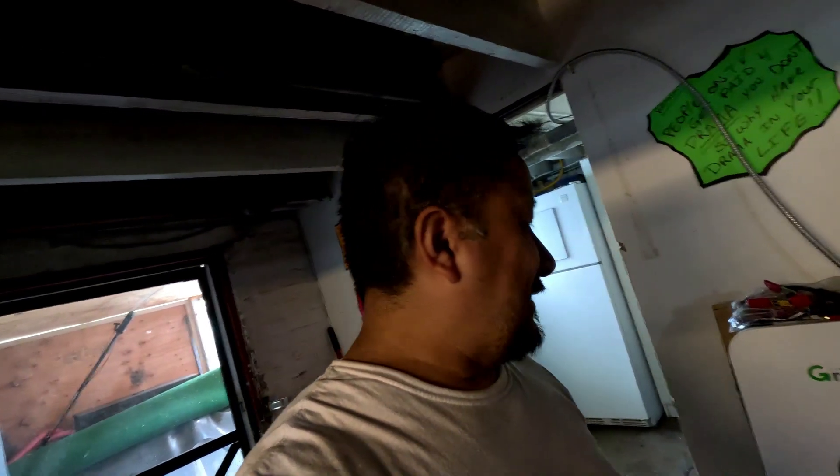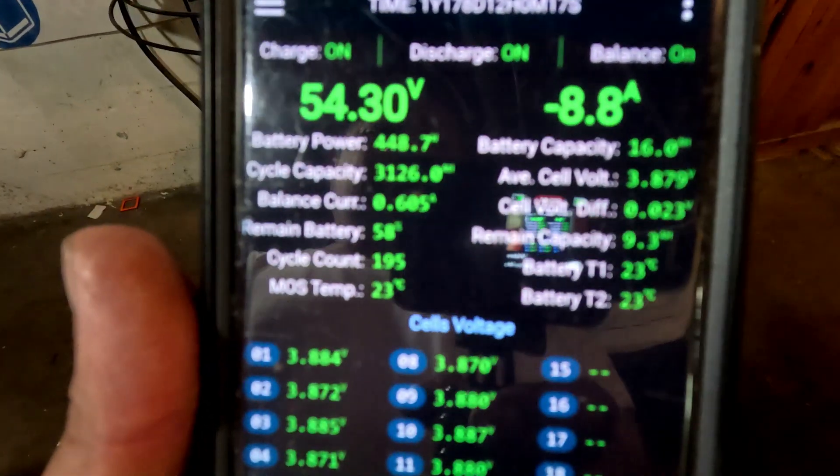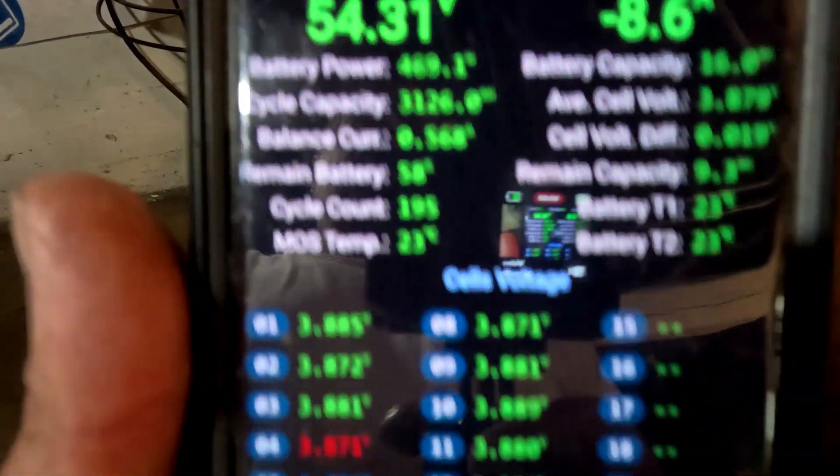It would jump from 54.2 to 54.7, but I've got all the way to go down to 42 volts. When that fan shuts off it went back up to 54.7. This is the battery management system — the air conditioner is pulling eight and a half to nine amps at 54.3 volts, and the state of charge on the batteries...